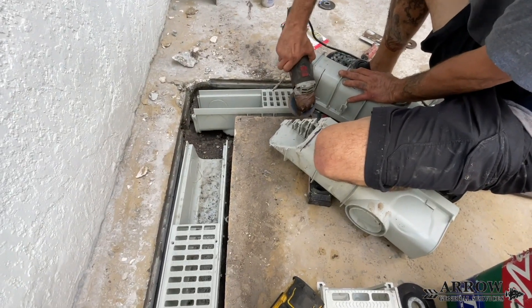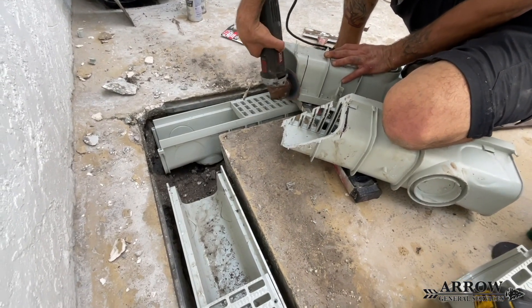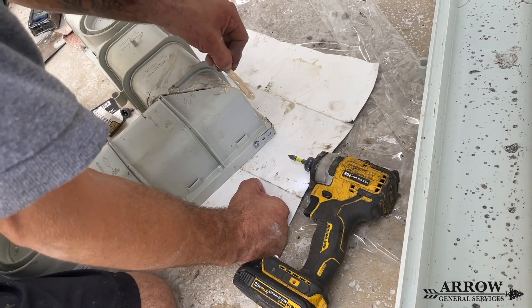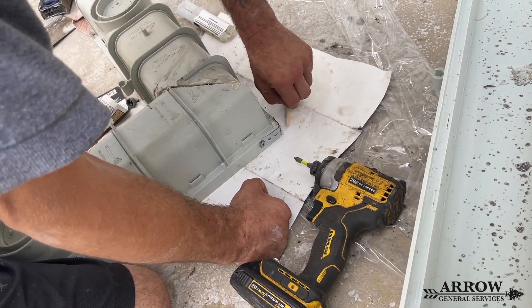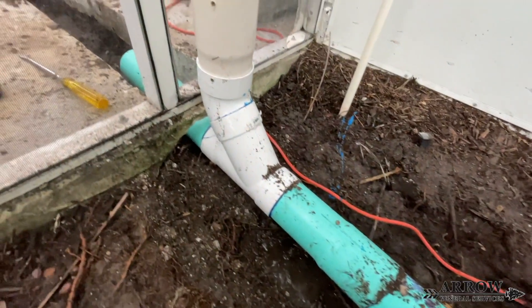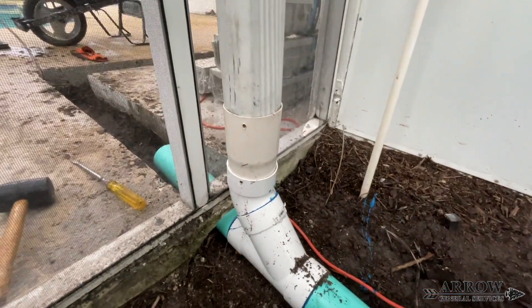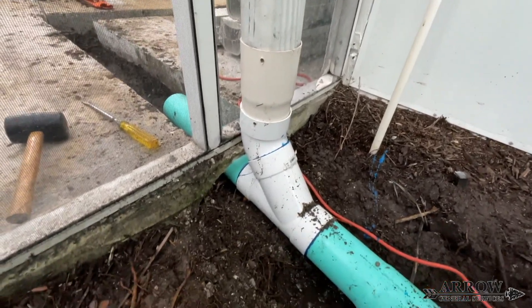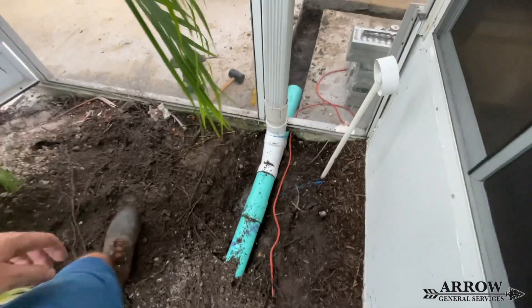To make this 90-degree angle out of the channel drains, we're going to take one of them and cut it at two 45-degree angles, both going the opposite direction. Then we're going to use a two-part epoxy to seal those together and put them down into our channel. The main line connecting to the channel drains is also going to have a gutter downspout dropping into it, so we're going to use a combination Y to catch that from above so it can dump directly into the main line and go to the sump pump.